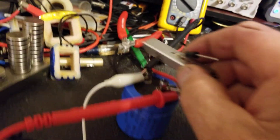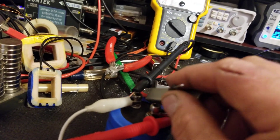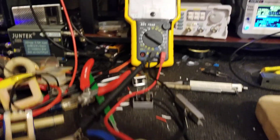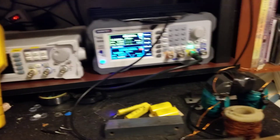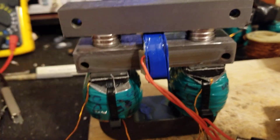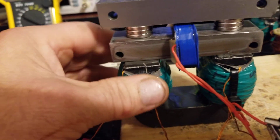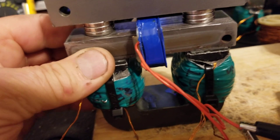A nice little arc out of this. Yeah, do it one more time so you can see. Yeah, six hundred and fifty milliamps. The cap fills pretty fast for thirteen thousand microfarads. The flux switching is going through this ferrite core, and I don't know how much more efficient this is going to be. I'm starting to think that maybe this might be the way to go, since this stuff wants to be switched a lot faster, but it seems to absorb the flux pretty well. Pretty impressive — this is going to be the way to go for a while.